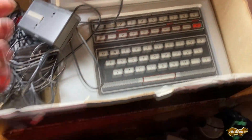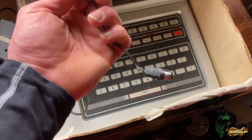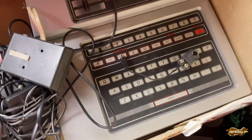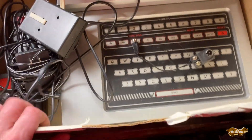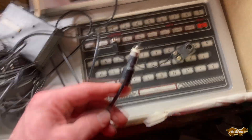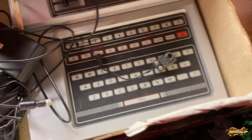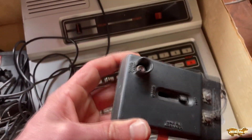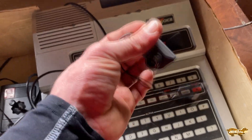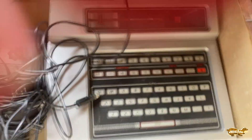One other thing on the RF: I rigged this thing up with just an RCA jack and a balun, thinking that since these switch boxes work at 300 ohms, the output of the Odyssey must be 300 ohms. However, literally just this morning I thought, wait — the output comes over coaxial cable, so it can't be at 300 ohms. I took this apart and confirmed that, indeed, there is some kind of impedance-matching balun in here. So while it does work in a pinch, it's wrong. Let's get this hooked up. It seems to have a reasonably clean composite output for right now.